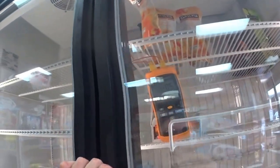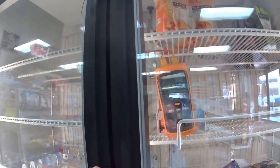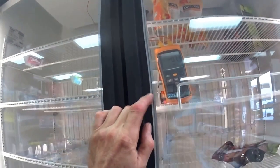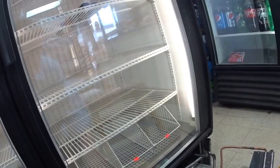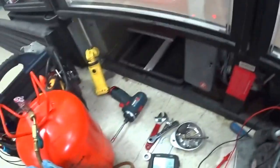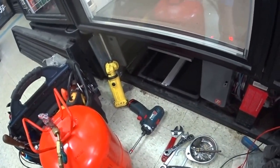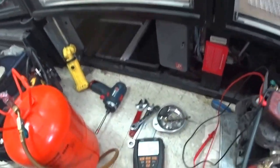Okay, I'm just below zero. It gives me a 20 degree Delta T. As the temperature is dropping it'll be down pretty cold later on. I only have 8 amps — that's easy. Head pressure is good now at 275. Suction is 10. The evaporator is minus 28. It's doing good. Okay folks, later.